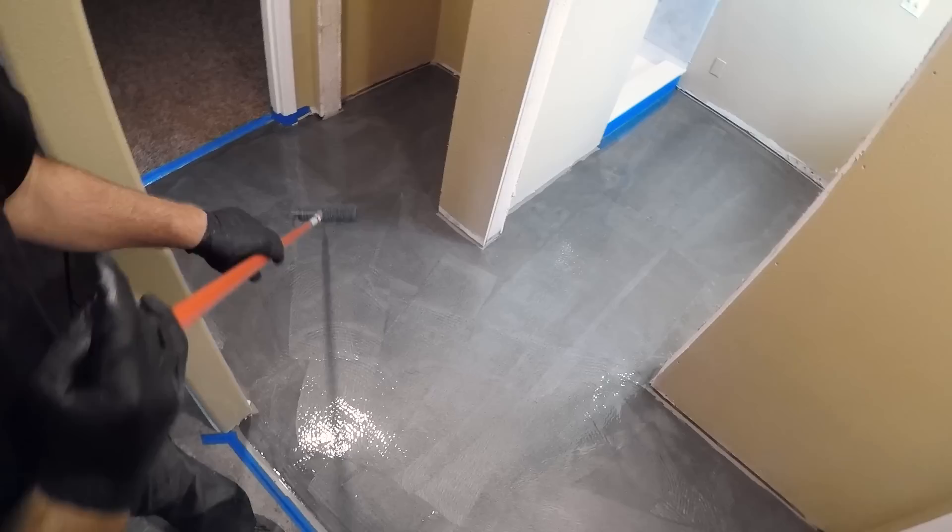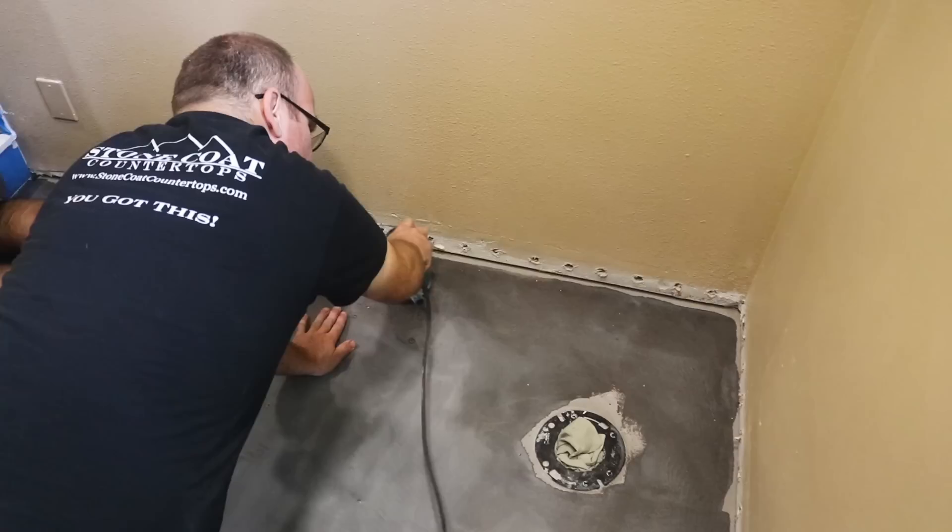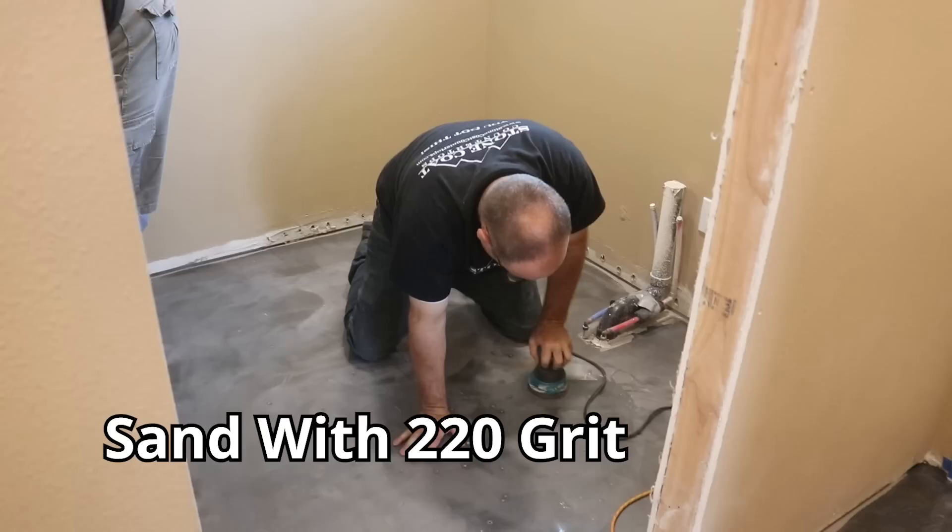It's been the next day. We're going to sand the floor, wipe the dust, and apply our flood coat. The first coat will have some bubbles, nibs, and high points — that's just the seal coat designed to stop air from coming into your flood coat.